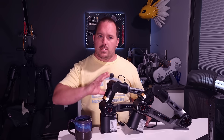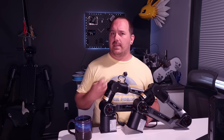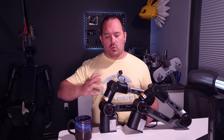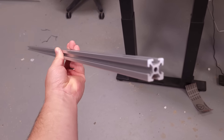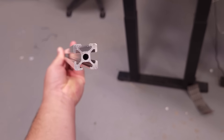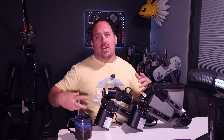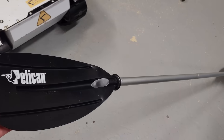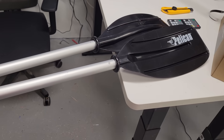I need to figure out a way to mount these arms onto the canoe without modifying the canoe, because it's not mine, but finding a way that's actually fairly light. The heavier the canoe is, the harder it is to move. So I need something that's lightweight but also rigid enough that as the arms are paddling, the whole thing isn't flexing. Extrusion is perfect for this — we're going to be using 2020 aluminum extrusion, mounted so it's squished between the gunnels and the yoke on the canoe. That way it should be pretty easy to get this whole setup on and off. We also need a way to mount a paddle onto the end of each arm, and a lightweight kayak paddle that splits in half should work perfectly.